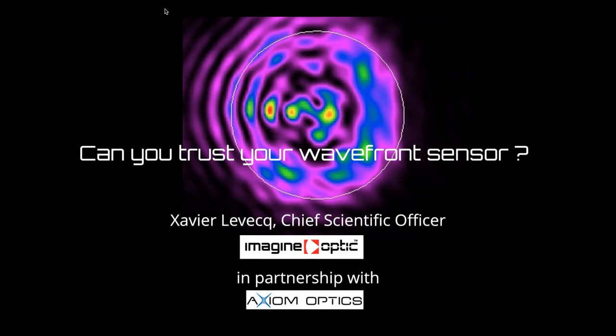But to start with, wavefront sensing has been around for a while now. I think Imagine Optic is a pioneer in wavefront sensing, and they had one of the first commercial sensors in 1996, I believe. Wavefront sensing applications are numerous and are found in many industries. Just to list a few, we see them mostly in laser beam characterization, looking at the phase distribution across your beam. This could be for research purposes, laser physics, or for industrial lasers, to optimize the beam to have a better focus, a better cut maybe with those lasers.